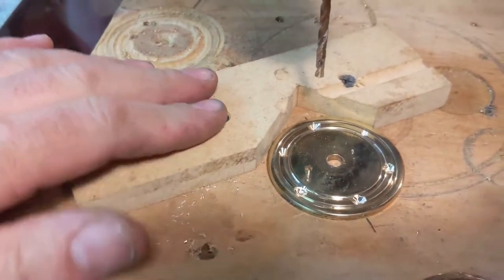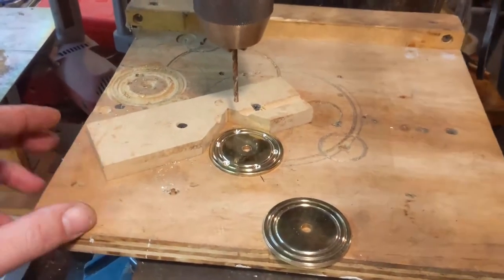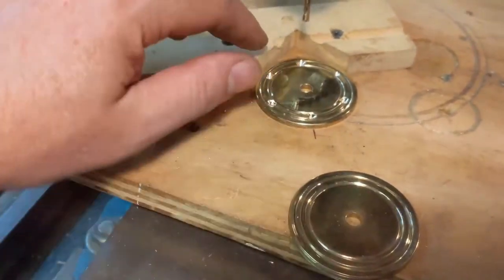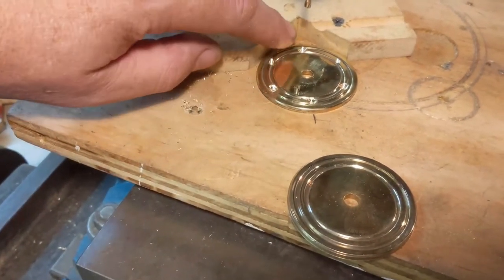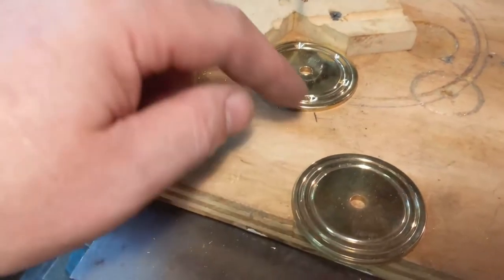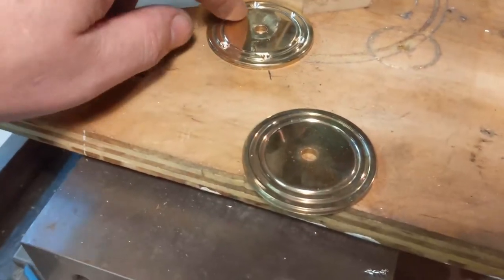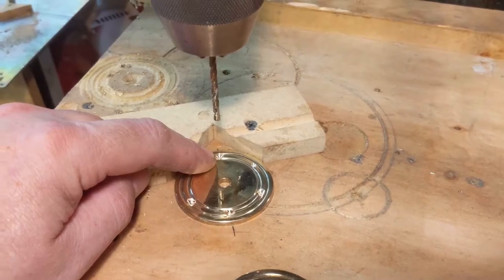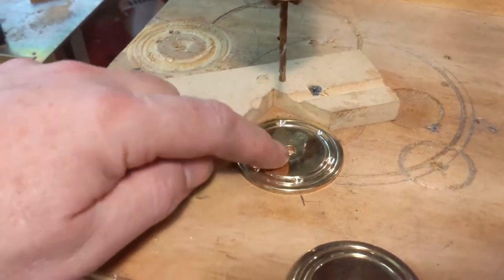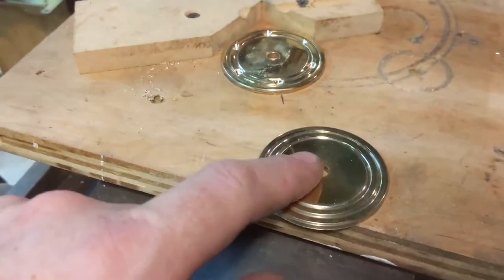Here's what the setup turned out to look like. I just cut this little angled wooden block and screwed it to this wooden platen. Now this piece can just be held up in here and rotated — it will keep the outside positioning the same no matter where I rotate it, so it's going to drill in the same ring. All I have to do is line up the bit with the starter cone that I just drilled, which will be kind of self-aligning. I'll go ahead and drill the first one completely and then use the first one to drill the second one.